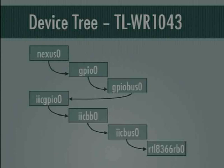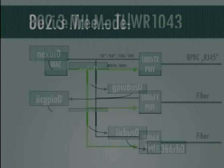So when I started out in December, I thought, okay, how can I do this? And so I started reading code. And I was quite amazed that almost all the bits are there. The only thing that I really needed to even touch is the actual switch driver. So the entire attachment, the entire hardware, is already in the tree. There were just a couple of places that needed slight adjustment. The major thing was in the I2C bus, because the switch chip doesn't implement proper I2C, but some bastardized form of it, I needed to relax the enforcements that are in the bus code to make sure that the transaction actually works. So that was actually quite nice, because doing all this bit banging by hand and doing all the logic behind it and just writing that code is highly annoying and error prone. So being able to just plug this together via hints is really cool.